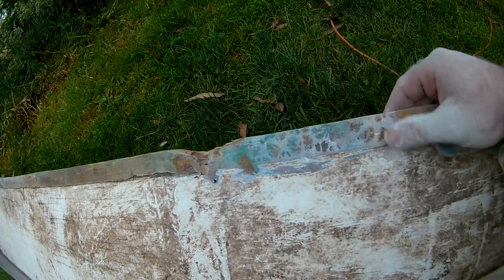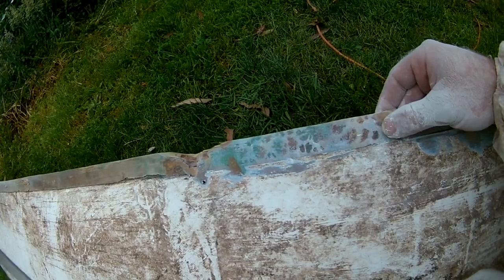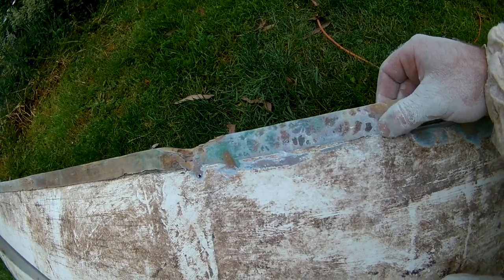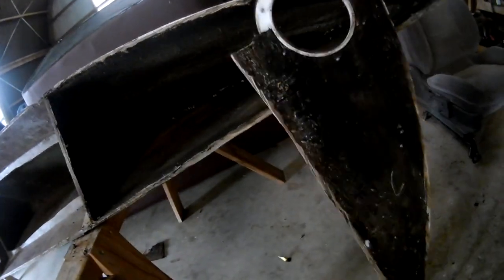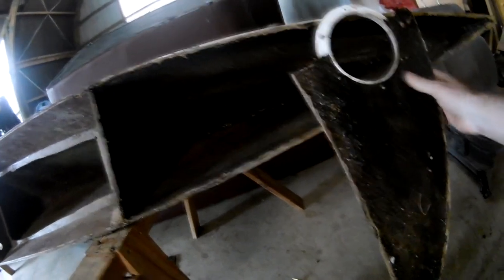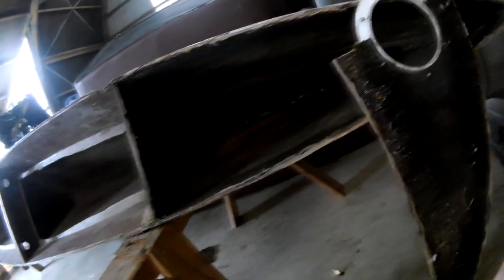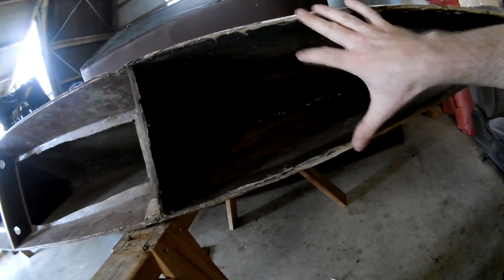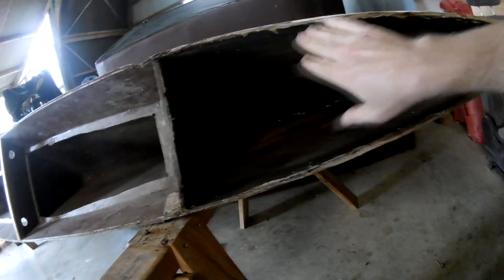Here you can see how bad the glue joint was. There wasn't enough glue and it probably didn't seem to cure enough. I just didn't have enough clamps to do this bit tightly — I can't actually remember if I used any clamps or just screwed it. There was one patch of rot under the foredeck; quite a few things had been living in there. When I cut the hole for the inspection port I probably never sealed the edge, then left it somewhere it filled with water. Of interest is that when this broke off, it was the wood that broke and the epoxy is still good.